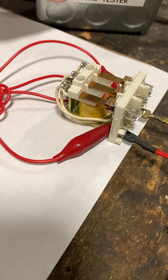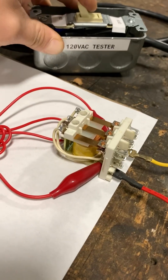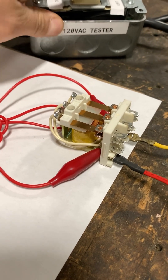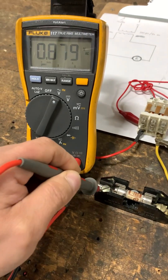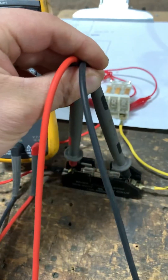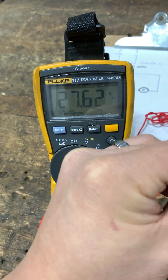You can see that it is not switching states like it should anymore — we have blown the fuse. Now we have voltage feeding into our fuse but no more voltage coming out. Doing a voltage drop right across the fuse, we can see a potential difference equal to our full voltage.